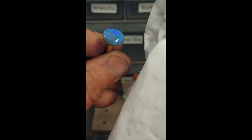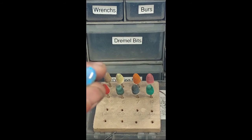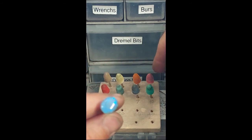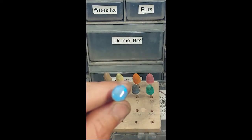In between each grit, I just wipe it down with a soft cloth — in this case I'm actually using baby wipes. They have a very small amount of alcohol and they're wet, which helps clean the stone off nicely. I'm going to go through the pink, which is 2.5 micron, then 1.5, then 0.5 micron grits, wiping it off in between each one.